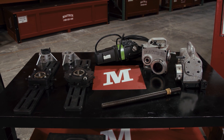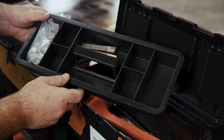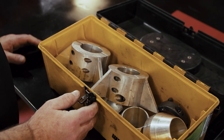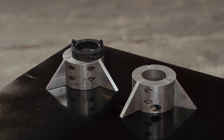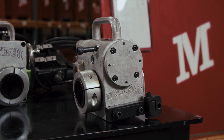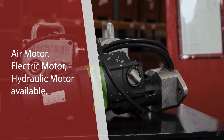Let's take a look at the major components we're going to be needing today. A lot of these components bolt together. The hardware is stored in the toolboxes along with tool bits and extension kits. We've also got the alignment cones and clamp collars, which rough-center the boring bar into your setup as your starting point until you get the bridges and bearings onto the workpiece. Then there's the bridges with bearing supports, the drive head with a built-in anti-rotation bracket, the feed screw, and the feed head. Then the boring bar itself, and finally the motor.